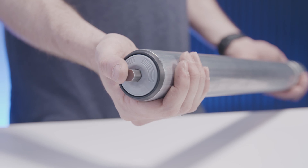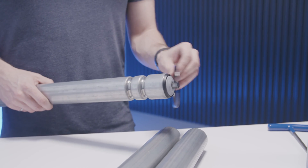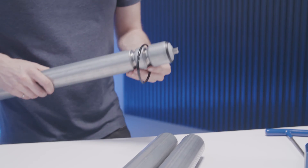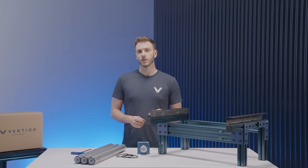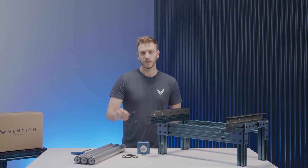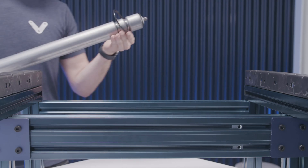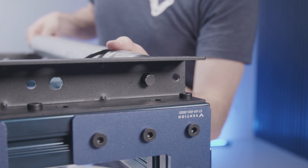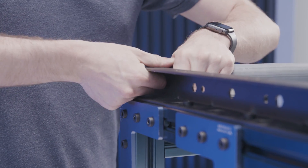Each roller has a fixed shaft end and a spring-loaded shaft end for easy installation. Start by placing the required o-rings onto the rollers before attaching them to the bracket. If the o-ring is connecting two rollers, use the smaller 257mm ring, and if it's connecting a roller to a motor mount, use the larger 306mm ring. You can then insert the fixed end with the rings in place into one of the brackets and, depressing the spring-loaded end, slot it into the opposite bracket.